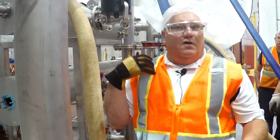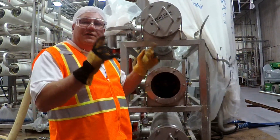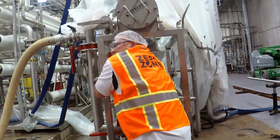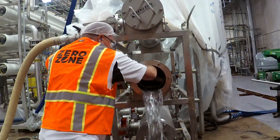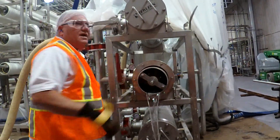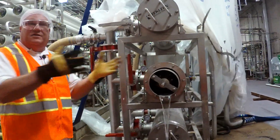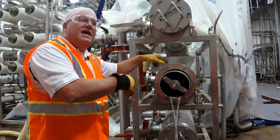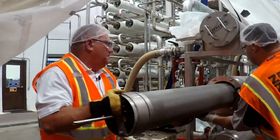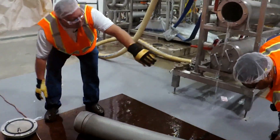Now we're ready to go around front and pull the whole assembly out. There are only two o-rings that hold the whole assembly in. You reach in here and grab the bar and give a good yank. The whole assembly will come out. Because the screen is 10 micron, water sits in there since it needs water to push through. Slide it out — there you go — and pull that piece all the way out, nice and easy.